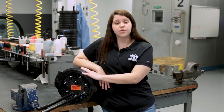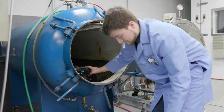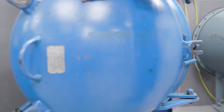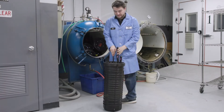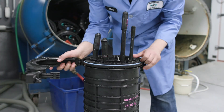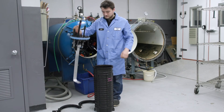Another test is related to water resistance, and this is determined by the deployment method being used for the closure. For example, this Coyote 9.5-28 dome closure would be used in a handhole. So for the standard, it needs to be submerged in 20 feet of water for at least seven days. The closure is put into a water chamber, then pressure is introduced to simulate the 20-foot depth. After about a week of being submerged, the closure is removed and visually inspected for evidence of water intrusion. If none is present, the closure passes this section of the standard.